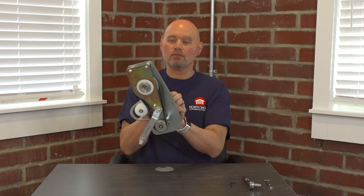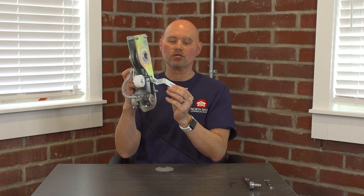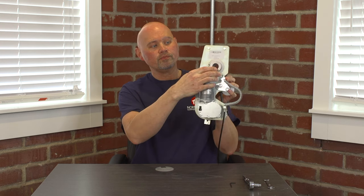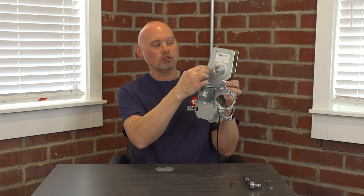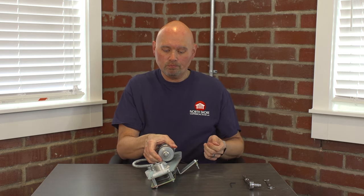With the Zapp, when it's mounted up on the door shaft, you have your torque arm bracket here that's holding it to the end bearing plate or horizontal track mount. You'll want to disassemble that, which will allow you to loosen up your two set screws. Sometimes you'll have a quarter inch keyway if it's a solid shaft. Once you loosen the two set screws, you'll be able to slide this off the door shaft — whether it's on the right-hand side or the left-hand side — and bring it down to the workbench, which will allow you to start the disassembly process.